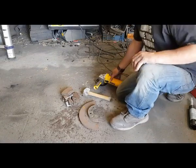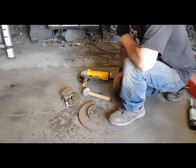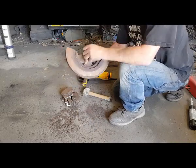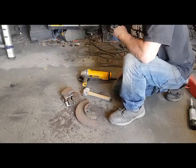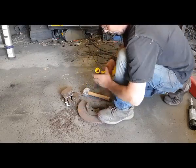If you're wondering where we get the cast iron from to melt down, basically the best method is going to a local garage and getting secondhand brake discs. They'll give them to you for free and they're good quality cast iron.